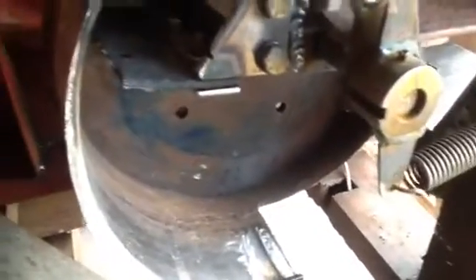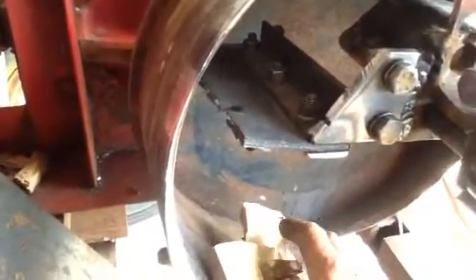The pieces that fall off generally land in this area here as they come around. This belting up here on a piece of angle iron, bolted in here — what that does is stop those pieces of wood from coming around and jamming in between this plate here and the wall at the cutting edge of the cutting drum.